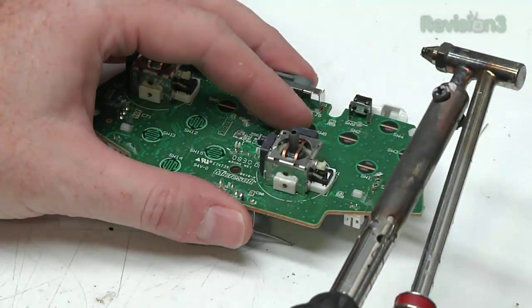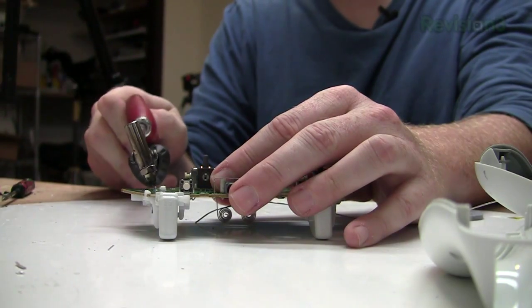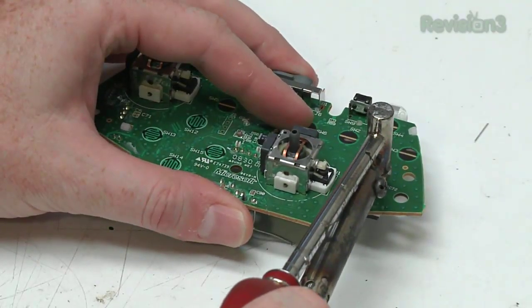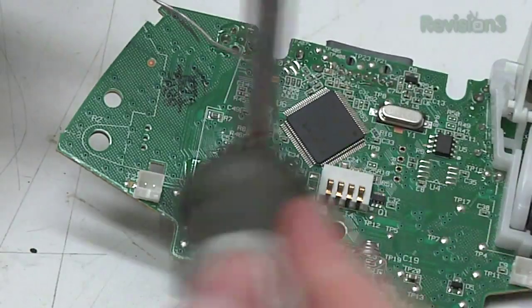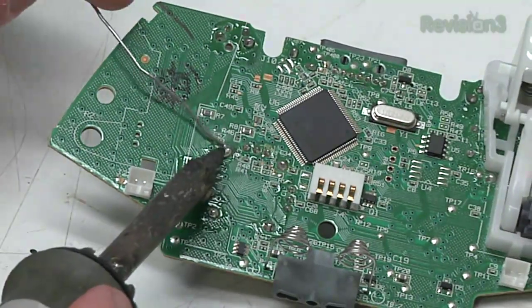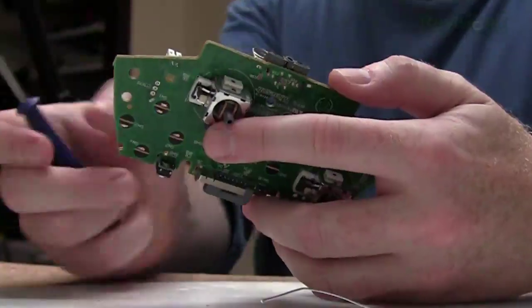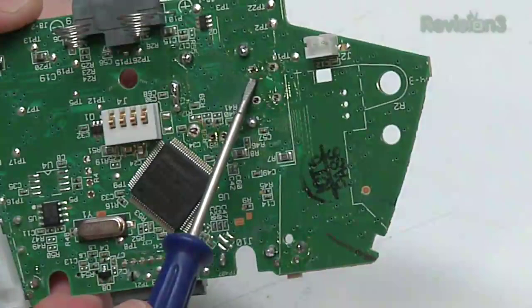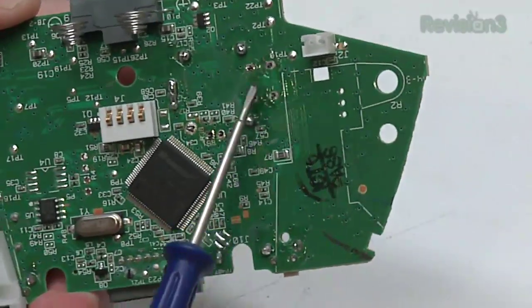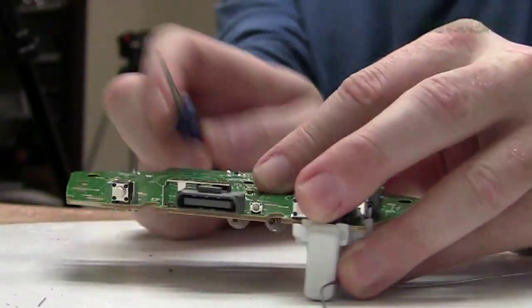The desoldering iron is pretty simple — it's just a 40-watt iron with a suction bulb. You push out all the air, put it down over the part, swirl it around, let it heat up, and it sucks up all the solder. We can repeat the procedure for the right analog stick — just heat up all the connections with some more solder. A good sign that you've desoldered something correctly is that you can see black expanse around the pins, showing they're ready to go. If you can move the pins with a screwdriver, that also means it's probably desoldered. Once you've got the piece desoldered, just stick a screwdriver in it and pop it off.